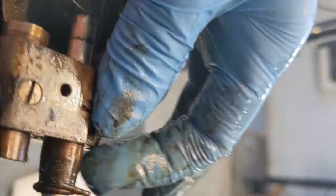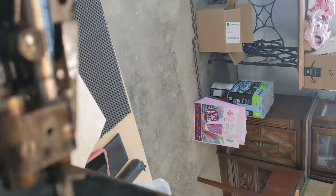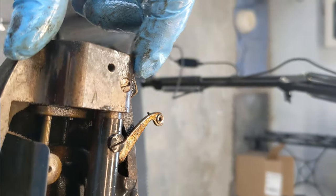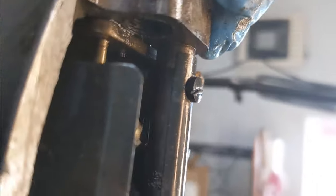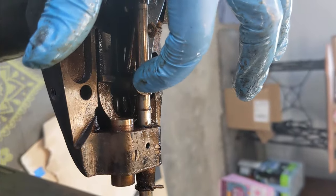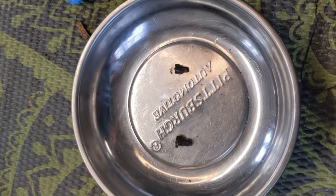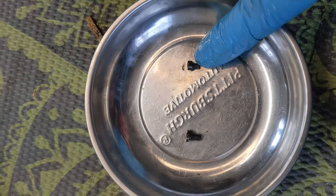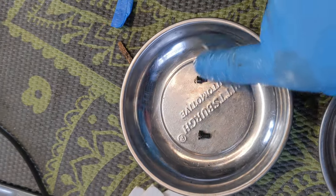Proceeding with taking apart my needle bar. It looks like there is a thread guide here. I'm not too sure how it's connected — I don't feel a screw right now, so I'm going to have to take a peek at that. I have three screws that look like they're connected: one up here looks like it's holding in a bushing, which I'm going to leave alone — I'm not pulling out bushings. Then I have this screw here which looks like it is connecting that needle bar to some other piece. Then I have another one down here which is the clamp. In my dish of needle bar screws so far — the tinier one is for the clamp that holds the needle on, and this one is for the needle bar clamp.